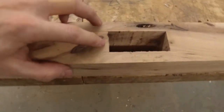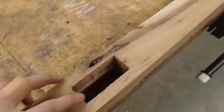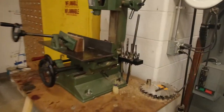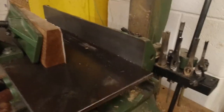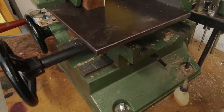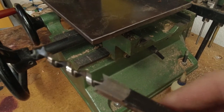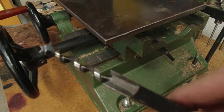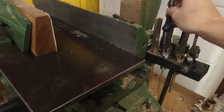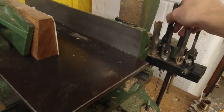Mortise that I had to cut, and unfortunately our square chisel mortiser, you really have to take care of these things well, and I really wasn't thinking and was using this bit without actually sharpening it properly. So I've gone and sharpened it a little bit more. You can see those flat faces. I could probably sharpen it a little bit better, but long story short, this bit actually started bending,